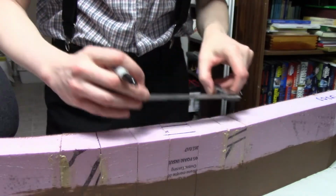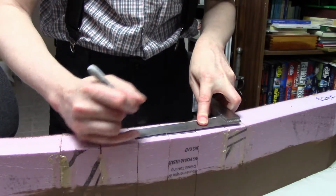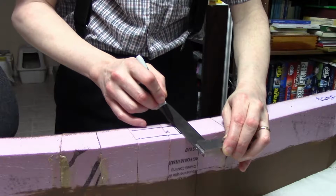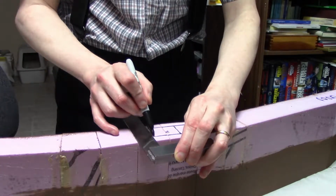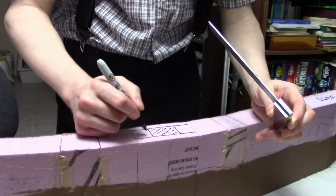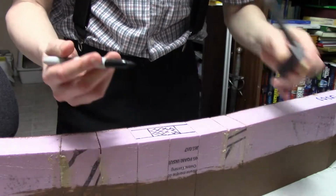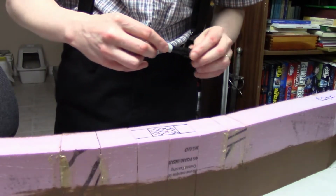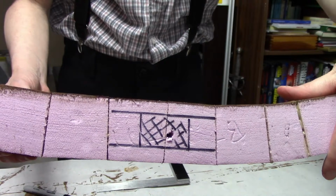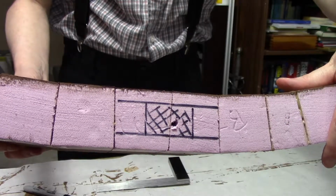Now, looking at it, because that's essentially between 2 sections, I'm going to mark both sections all the way and then go in 1 inch from each side to create the pocket. And that puts the area I want to remove predominantly centered where the leads are going to drop down, just to give me lots of room. So there is a more close-up view. The hatch marked area, you can see the hole in the center. So that's what I'm going to use the router to pull out.